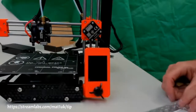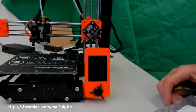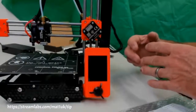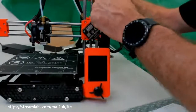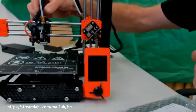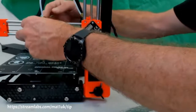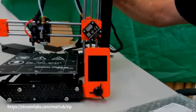Well, the thing is, RJ, it all harks back to originally when 3D printers were built, they were all direct drive. Now, somebody's going to tell me I'm wrong here, but they were all direct drive. So when you talk about an extruder, in the original time, this whole part here, the motor that pushes the filament through and the hot end was all one piece. It's what they now call direct drive, is how they all were. So the whole thing was called an extruder. Now, when they went to the Bowden system, which is the hot end and fans separate from the actual motor that pushes the filament through, that is the Bowden tube. That is the name of that tube.